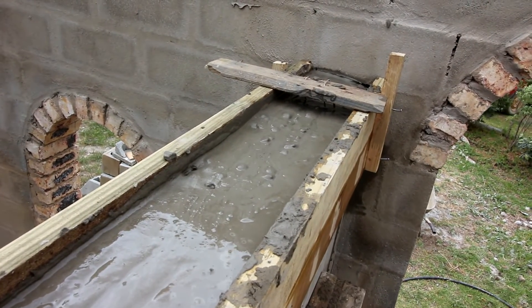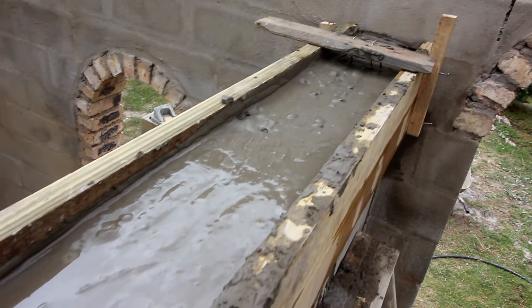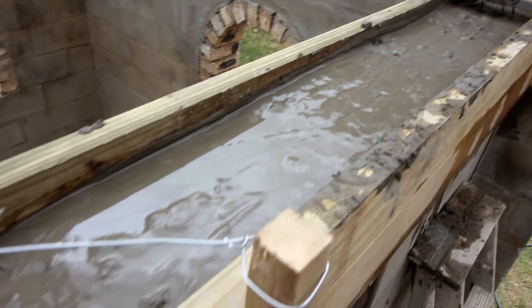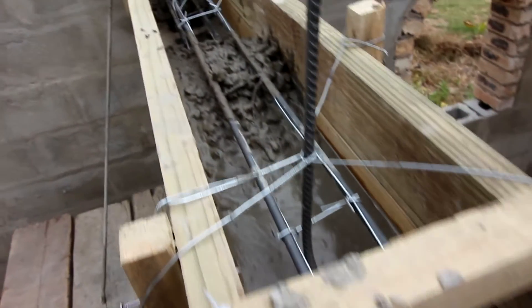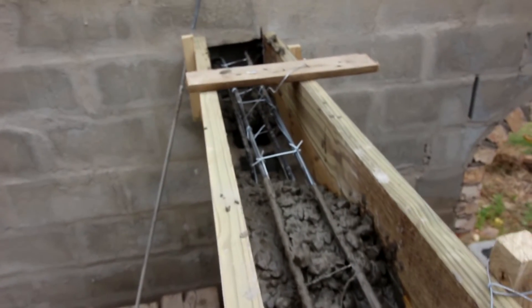As always, it's taken more concrete than what I thought it would take — two pockets of cement so far, and about six wheelbarrows of sand, six wheelbarrows of stone, but we're getting there and we're going to win it. Today it will be up. They're saying four millimeters of rain later on, but I don't mind with the concrete. I may cover it, but it doesn't really matter — it won't do any damage.